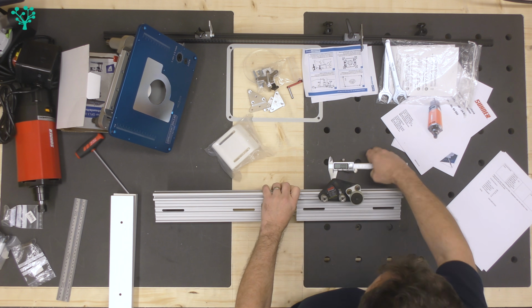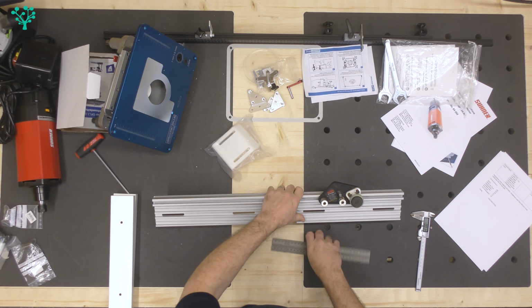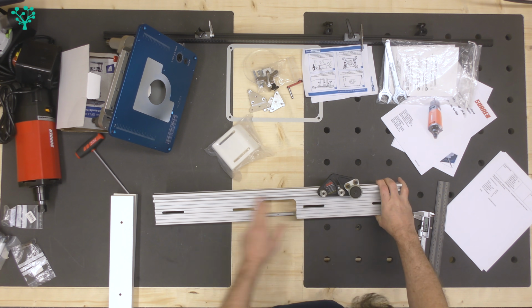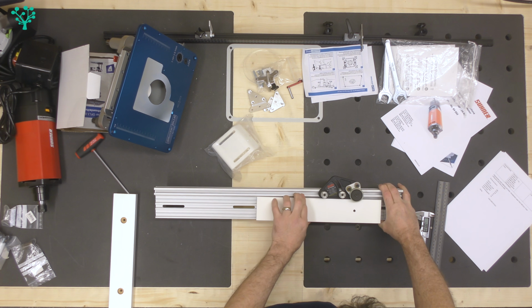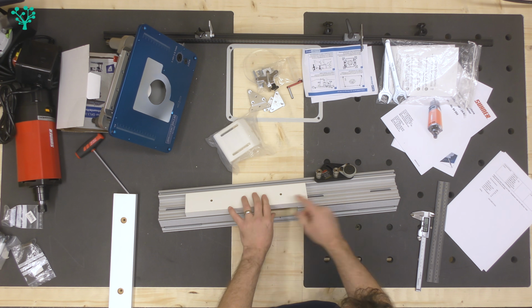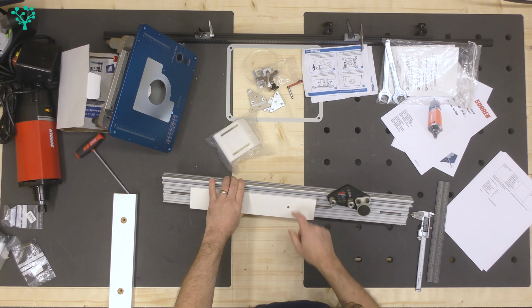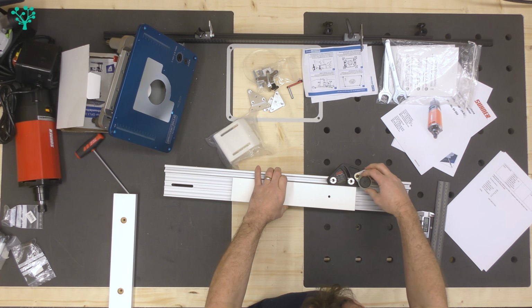So I can actually start to work on stock and still use featherboards about 60 millimeters. So that's a lot of clearance between that board and the base. Really generous. So I was really quite pleased to see that. Excellent use. But what I'm not so happy to see is these supplied boards are slightly thicker than that fence there. So that will now foul inside my fence system.